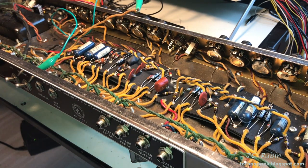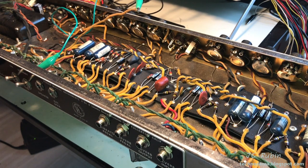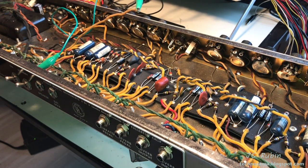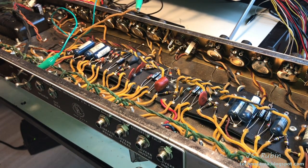It takes about 2 minutes for this amplifier to become non-lethal after I shut it off. This is something you have to constantly keep in mind when you work on these after you shut off power to go do your next step or you're dead, right?